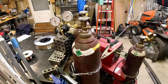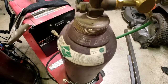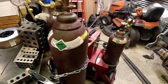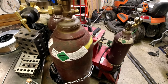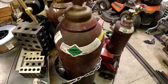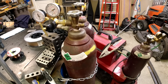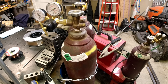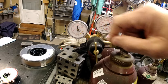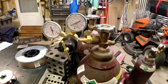When you go looking for gas, look for a supplier that can supply you with C25. There are several other gases out there, but as a generic basic gas C25 works very well — 75% argon, 25% CO2. Just about every area is going to have a CK gas supply, a Praxair, or an Airgas. You'll need a regulator to adjust your gas flow. A good place to start is around 20 CFH. Back it off and you'll see it in your weld — you'll get pits, which is porosity.